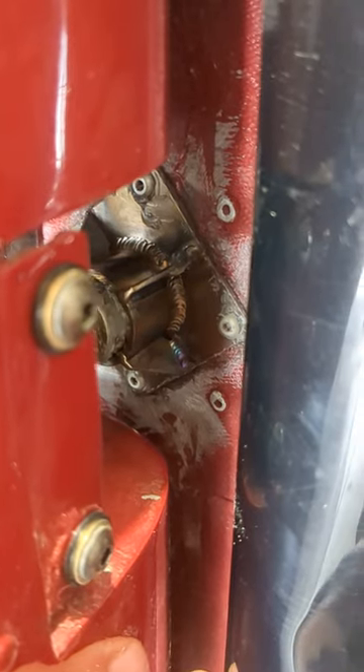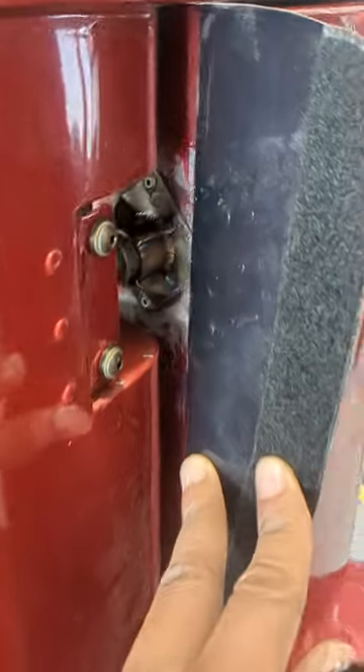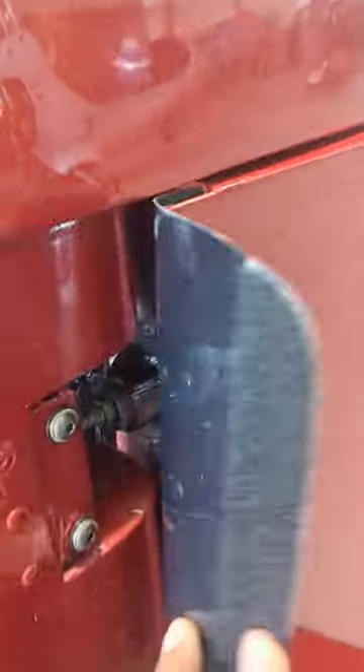You can get this part from us in a kit with the safety directive. You will need a number 25 drill bit, a pop rivet gun, some safety wire, and safety wire pliers. If you are not comfortable, use a mechanic. It should take only about an hour to an hour and a half of work. To do this, you have to take the rudder off.